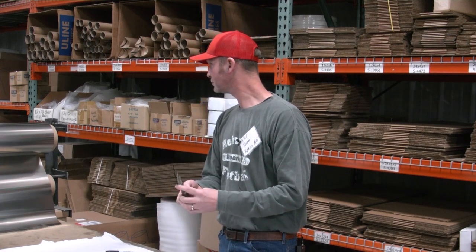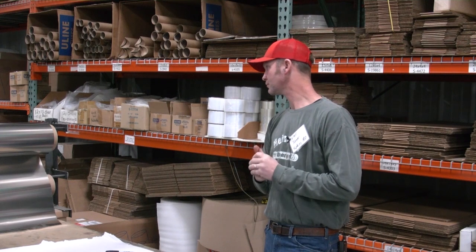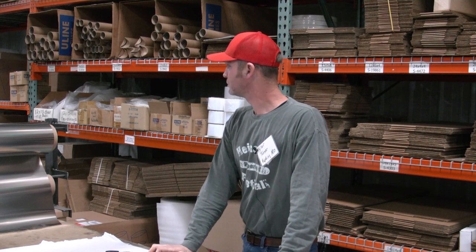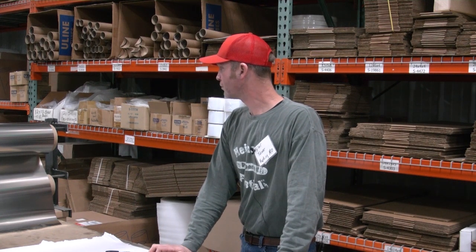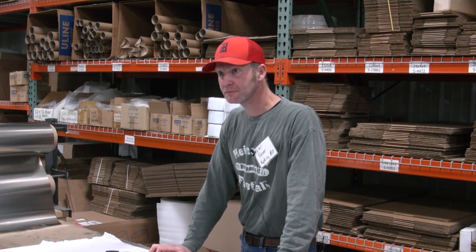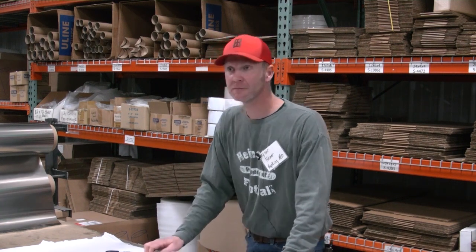There's two ways you can talk about it. You can talk about how much of the lock bar is covered up with your blade face, that contact point, or you can talk about the blade. And it's not normalized out in the community, so each guy might be talking about two different things. Here we're talking about how much percentage of that blade thickness is your lock bar going over. So if you had an 1/8-inch blade, your lock bar is going over a 32nd, right? Yep. 16th. Well, 16th would be half. Well, 50% would be half. Yeah, excuse me. And then a quarter would be 32nd.